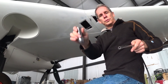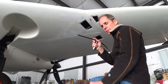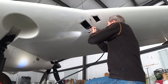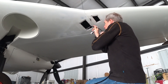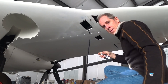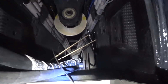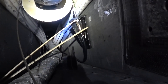I've already got conduits in the wing that run back to the inside of the back compartment behind the cabin. So there's the cable sleeve — I've got a whole bunch of that. I'm running it up through the conduit into that back compartment where the gear is, and from there threading it up the center of the keel to the front where it needs to live. It's strong enough that I could just thread it through without having to snake it. There it is pulled up to the front.